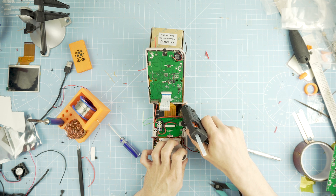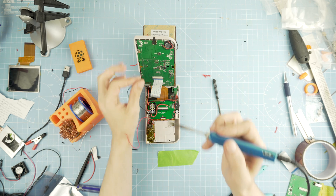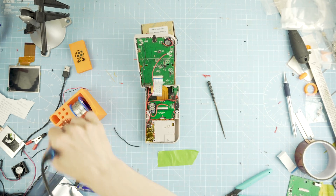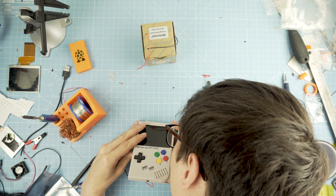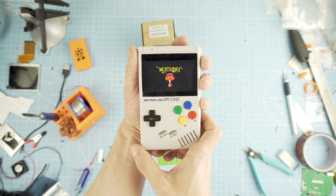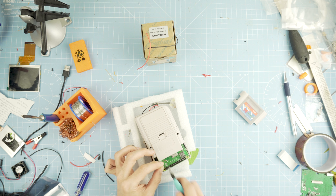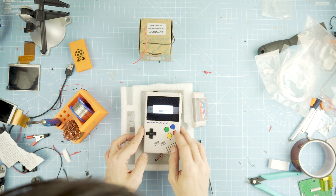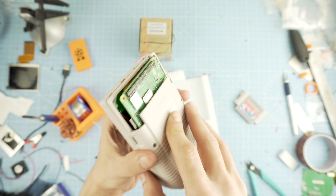If you have the battery mod, reattach the micro USB charging connector with some glue. Now solder the two remaining power cables on plus and minus on the PCB — you will need longer cables than usual which will need to be tucked in on the right side of the case. With that done, start closing the case, make sure all wires are tucked in, and give it a first test. It works — the screen is rotated 180 degrees, but that's simple to fix: just add 'display_rotate=2' in the config file. Then solder the USB wires — green is D-plus and white is D-minus. If your buttons don't work, press Up and Select for five seconds.